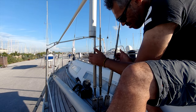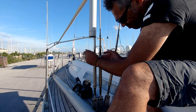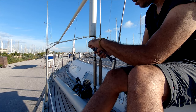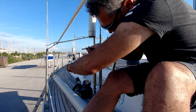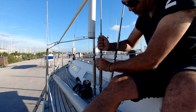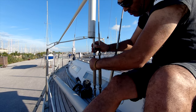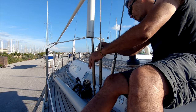The mast is held by different cables called the rigging. Basically, there are the forestay in the front, the backstay at the rear, and several shrouds on each side of the mast. All of these elements make the rigging, which is attached up to the mast and down to the deck by the turnbuckles on stainless steel plates.